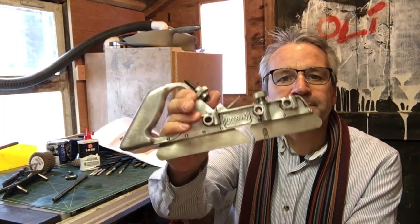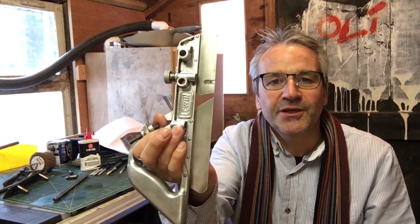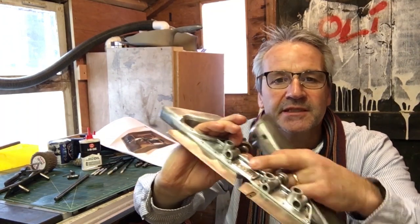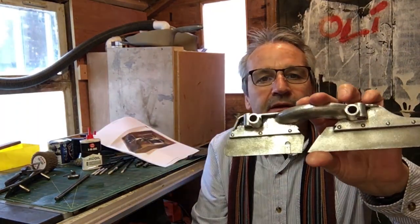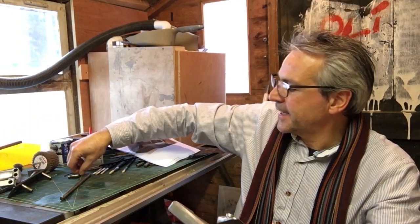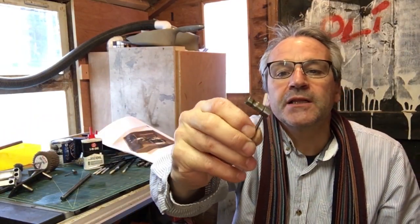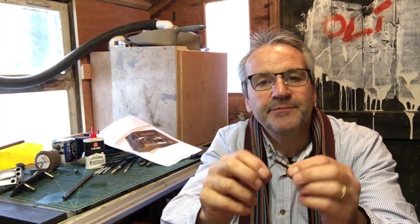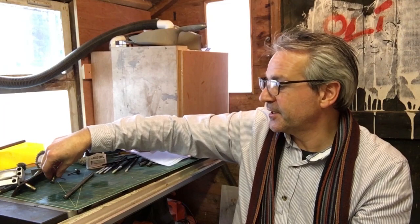I've finished the cleanup of the Lewin combination plane and it's come up really nicely, but it took a lot of work on the wire wheel. All of the steel was basically black. The ally comes up quite easily but I had to take quite a lot of paint off. I found out the handles do come out — I was missing a couple, so I had to make replacement bars out of a bit of steel. I also had one that had snapped off which I had to drill out, which was a bit of a pain, but I managed it.